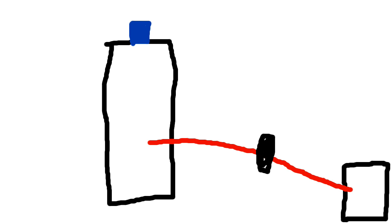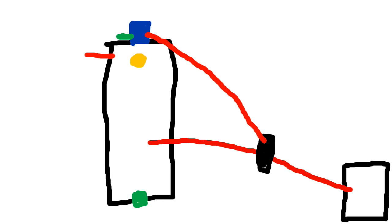A simple plastic tube from the one-way valve to the air pressure stat, which will relieve the motor when the preferable pressure is reached. One safety relief valve. One drain valve. One manometer, about 10 bar, so we can see the pressure. One fine pressure regulator with air filter to trap the moisture. And finally a 3 bar small manometer.